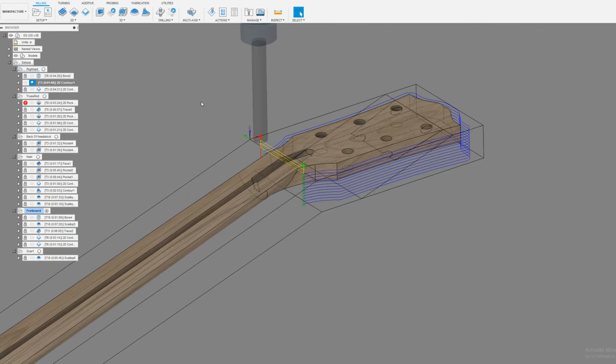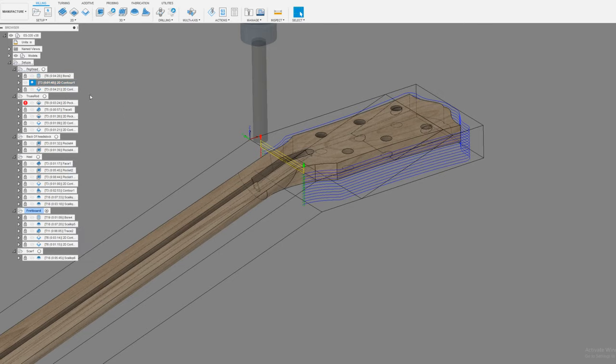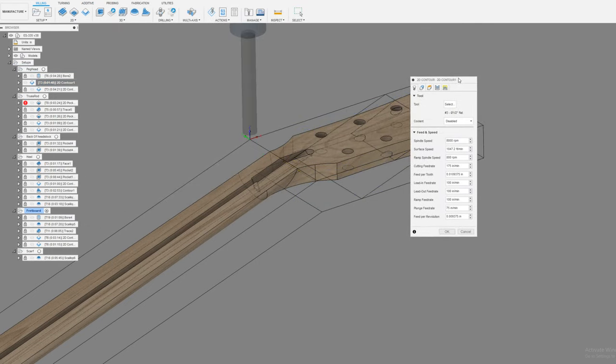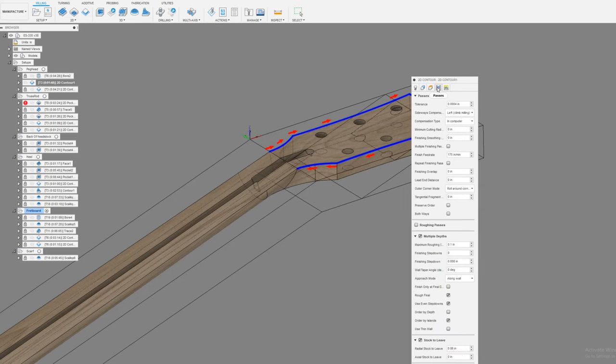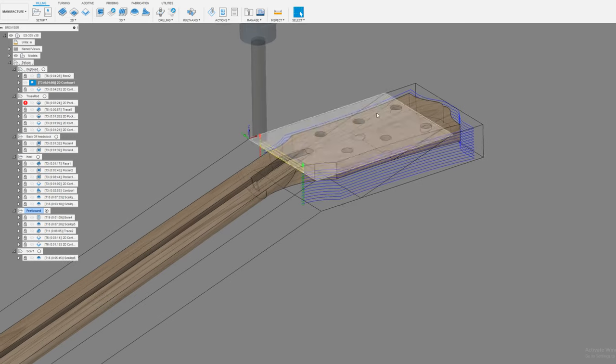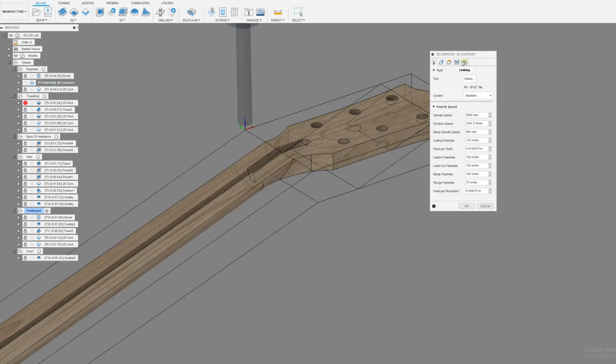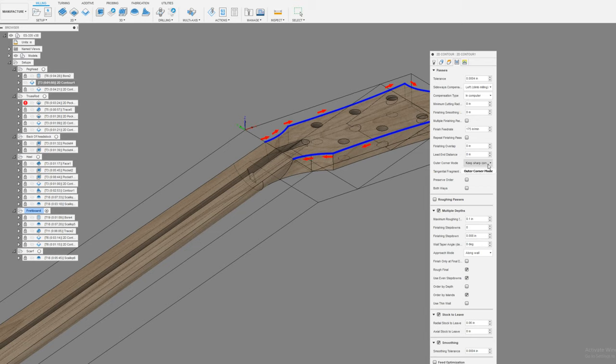I'm not sure if you guys can see that very well, but okay, I'll bring that Fusion window back in where you guys can see it. Edit. Okay, put it right here. Okay, so now you should be able to see it. So where you have this option for roll around corner or keep corner sharp, or keep corner sharp with loop. So sometimes when you go to keep corner sharp and you have multiple geometry selected like this, it'll just give you that funky little loop thing. Oh, it didn't. I've got all kinds of messed up here now. Keep corner sharp, tangent 0.5.